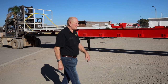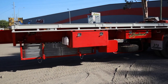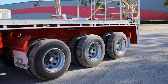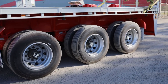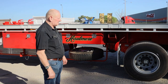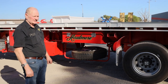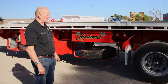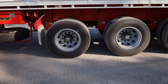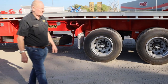From the ground up, these units are West Australian spec with 11R 22.5 by 16 tyres, standard 285 PCD, 10 stud wheels. My preference is for drum brakes and we have a 2.7 metre spring suspension. Eastern States trailers have a desire for airbag — the regulations there allow for better carrying capacity — but West Australia doesn't like that. The brake system is compressed air brake, to EBS compliance, which is the current regulation.